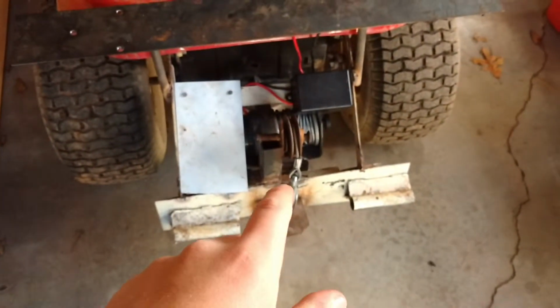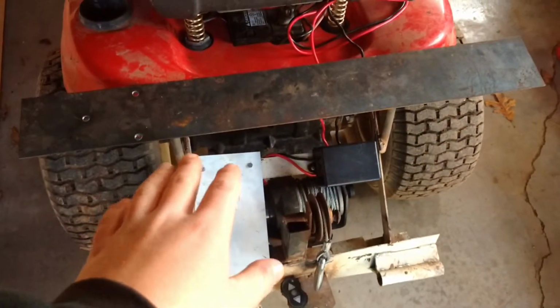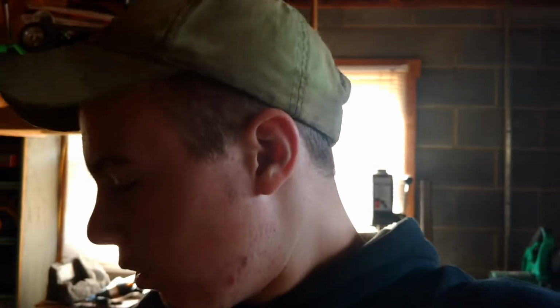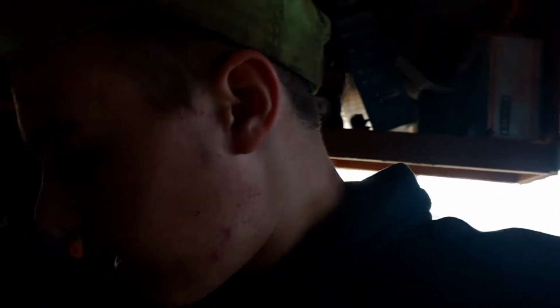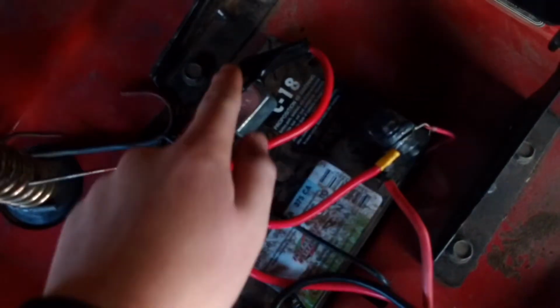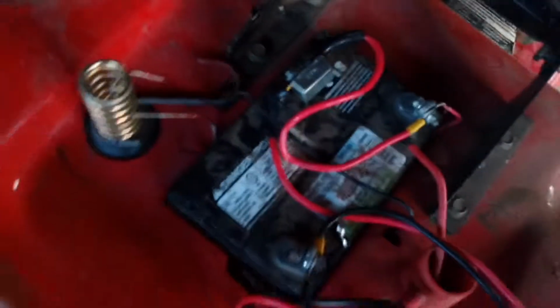So yeah, that is about all for this video. Now, like I say, again, make sure that you do some stuff to cover up a lot of the electrical stuff that's outside, like the nuts and bolts and where the wires connect. Make sure you do something to waterproof those. Cover them up with some heat shrink tubing, or if you can get the wire caps, which this does not have. Oh yeah, it does here. It does come with 2 wire caps to cover the nuts here. If you can find some of these that'll fit, like down there, where I have mine covered up, it'd be better all around. Just keep it safe. And like I said, make sure you get the little rubber caps in there, the box and everything. But yeah, that's all for today's review.